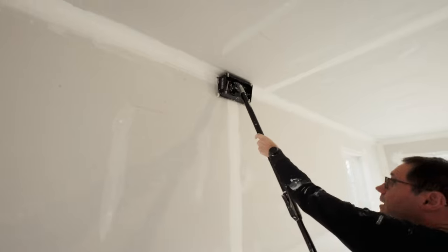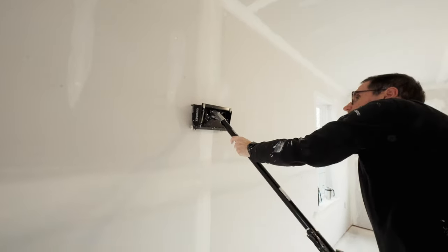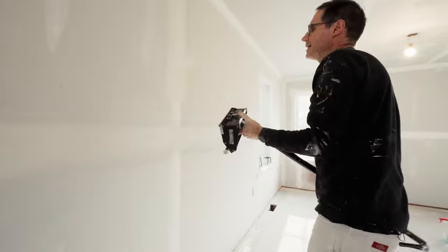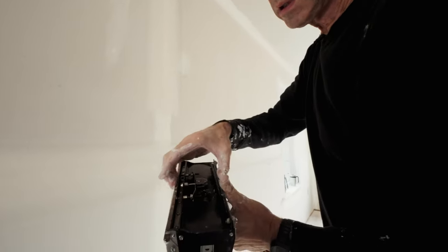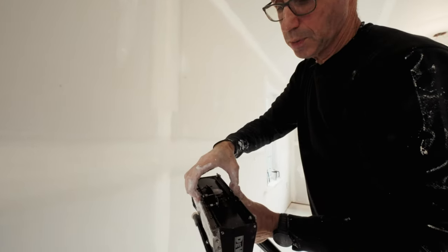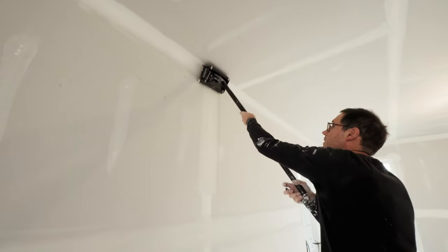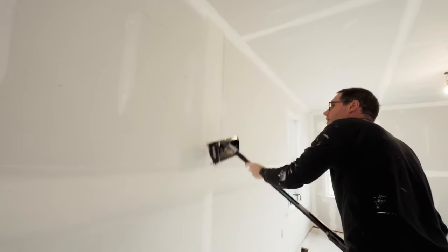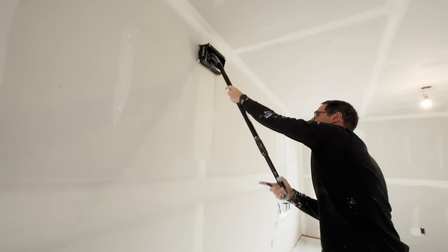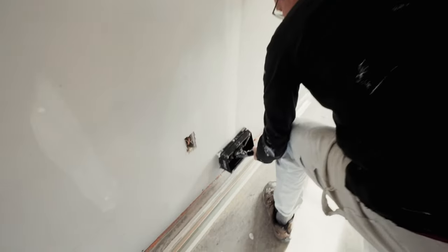I just start right up against the ceiling, putting a lot of pressure on it, pulling it right down. Right away I can see that I'm not leaving enough compound, so I'm going to make an adjustment — turn it to zero again. As I turn to zero, I pull back slightly on that edge. You can see what happened: now I'm coating and hiding the tape much better. That little adjustment ended up being necessary.